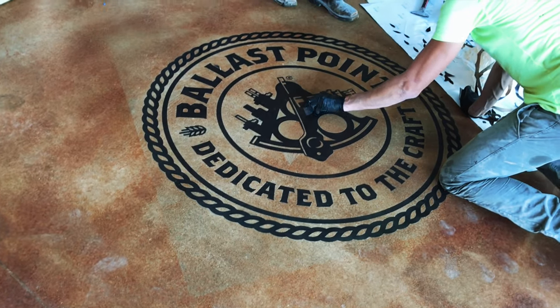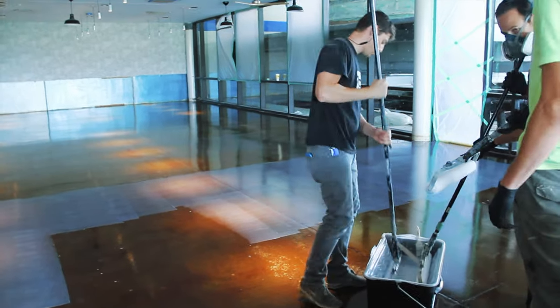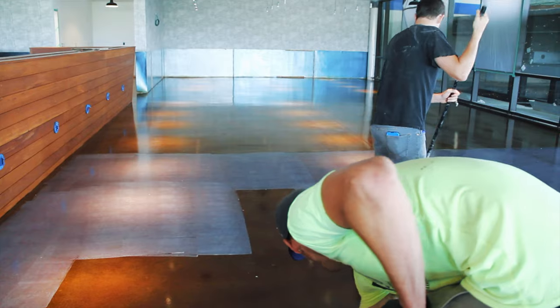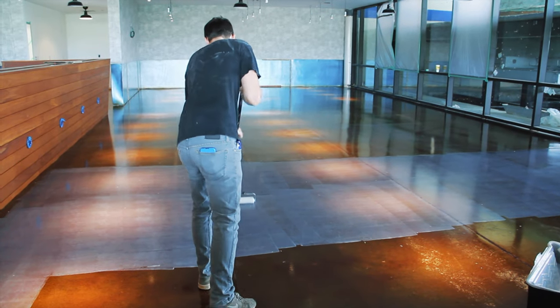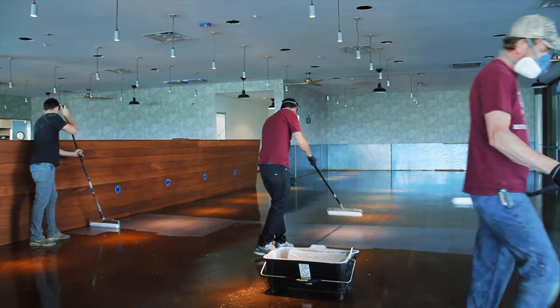On an old floor like that, we assume there's probably a little bit of moisture coming through, so we're going to use a breathable sealer. It allows moisture coming from the ground through the concrete to come out and evaporate. If you use something like a high-solids epoxy, it'll trap moisture underneath and make it cloud up. So we use a water-based epoxy and just roll that on the entire surface — cut in the edges and roll it on. It's kind of hard to mess up; you don't really see roller marks. It's a formula we've tweaked a bit, packaged with our labels, very similar to other water-based epoxies — it goes down so easy.